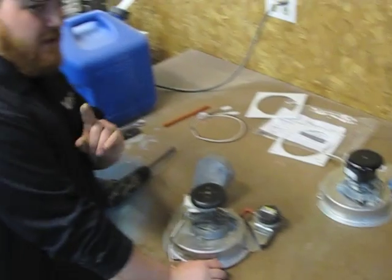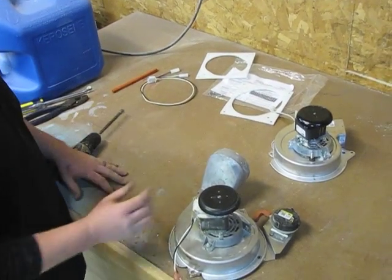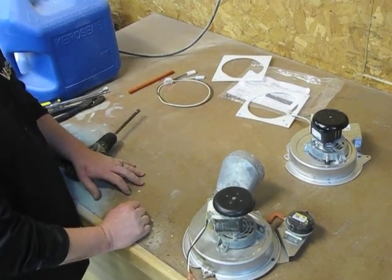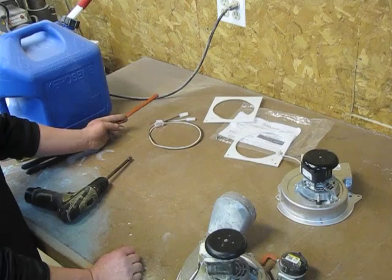What you want to do is clean this gasket off of the back of the collector box. After cleaning the gasket on the collector box, you want to find a nice flat surface to do the rest of the work on the inducer motor. This is the new inducer motor — it comes with two gaskets, a wiring harness, and a new vacuum line.